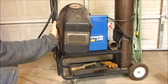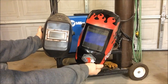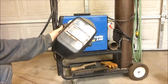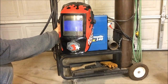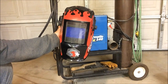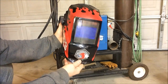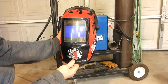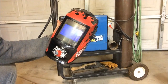Get yourself a welding helmet. This is a flip-down welding helmet — you can probably get these for $25 now at Harbor Freight. Nothing can go wrong with a flip-down. The other style is an auto-darkening welding helmet. It auto-darkens the instant you start welding, so you can leave it down and see through it up until the point you pull the trigger. It's a beautiful thing — makes life really convenient, but it's about $250 to $350 depending on the brand. I got mine off the tool truck.